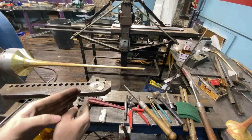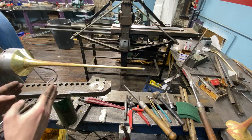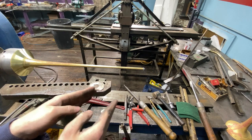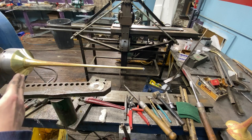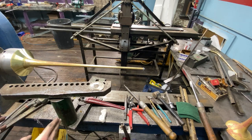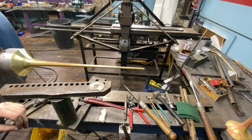We draw bells using a PETG draw — the most accurate draw I've ever had. The point of the draw is to give a consistent bell shape. If you draw and spin tight you have actual consistency. If you get pileups, the entire bell shifts down the taper and gets longer — your shape changes in the throat, which is a huge contribution to how a trumpet plays. That's one of my main ideas for why factory instruments play so differently — I've seen pileups in factories like crazy.